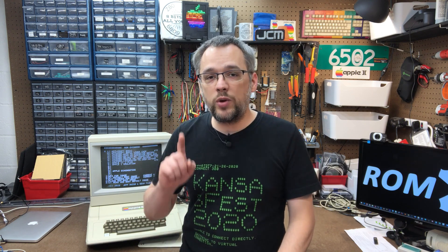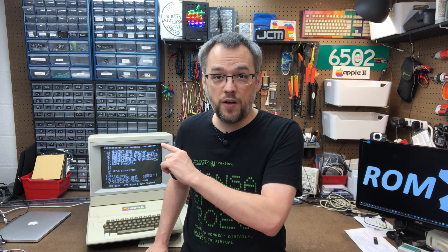I'm going to tell you. First off, it can hold several different ROM images, so that's cool. Secondly, they're switchable and selectable at power on, so you don't have to get into the machine, flip switches, have a switch on the outside, take things apart or do anything to pick the ROM image you want at boot. And finally, you can flash the images from the Apple II itself, right off the floppy disk, without any special tools. One little additional thing is that it has an optional add-on that allows you to change the character ROM, so you can change the on-screen font at power on too. Super cool.